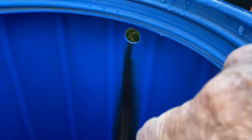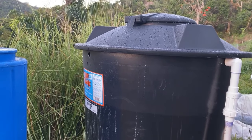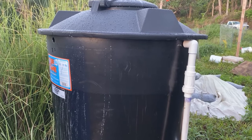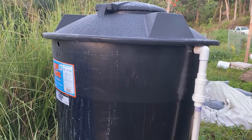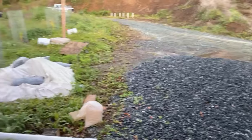See this? It's a rust stain from where the water ran out. It's a lot of rust — it's bad. Had a major fail with the sand filter. The rocks that I used, I just gathered them up around the property, and they're full of iron. I didn't notice it, but yeah — it's pretty much iron ore.